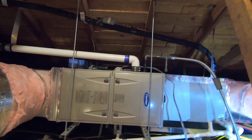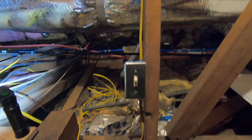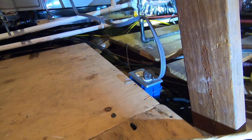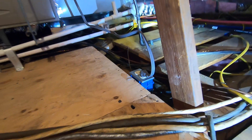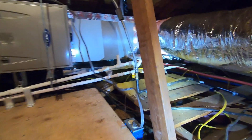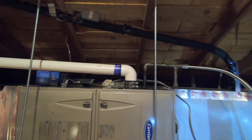We did have to run electrical to the attic to power the unit, as well as put in a light. We have a switch right here, a light above, and a plug where we plug the furnace into a 115-volt outlet — all moved up from the furnace closet. You can also see our gas line right here. We ran that about 14 feet across the attic to the gas flex, put a sediment trap on it, and that goes into the furnace for the gas supply.